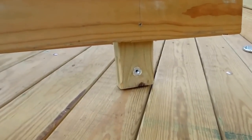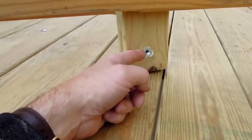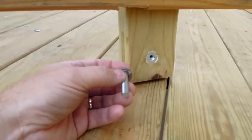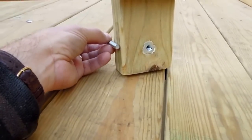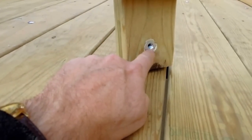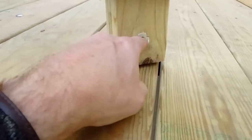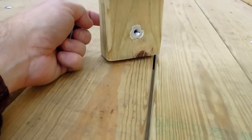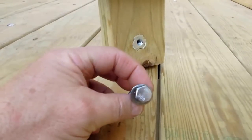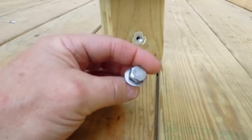One other feature I wanted to show on the tailgate is the T-nuts, which are on the opposite side of the tailgate. The fastener goes through the outside of the stake pocket and comes through like this. I've glued them in, and the idea was that as I tighten the bolt, it actually pulls the T-nut into the wood rather than attempting to pull it out from the opposite side. This fastener, by the way, is stainless steel — as most of them are where I had the option.